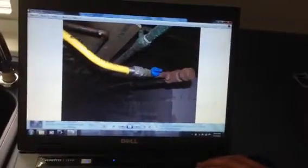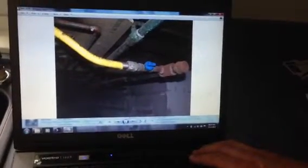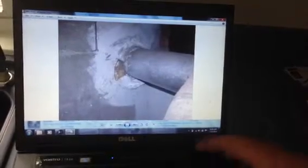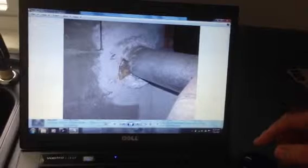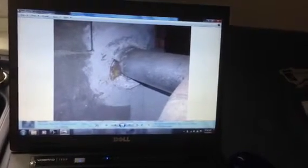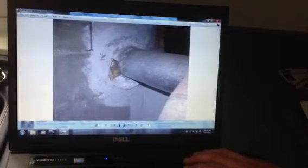There is natural gas to this home. There's a gas meter on the front of the house, and the natural gas pipe runs to the gas log fireplace, which is currently shut down. This is the venting for the heat — we need to get a complete seal so no combustion gases come into the basement, as they currently are. It smells rough down there when the heat is running, so that needs to get fixed and made safer.